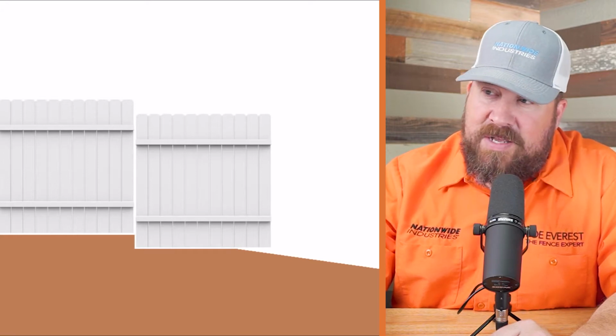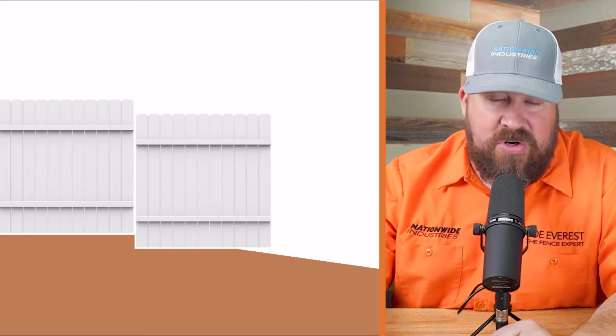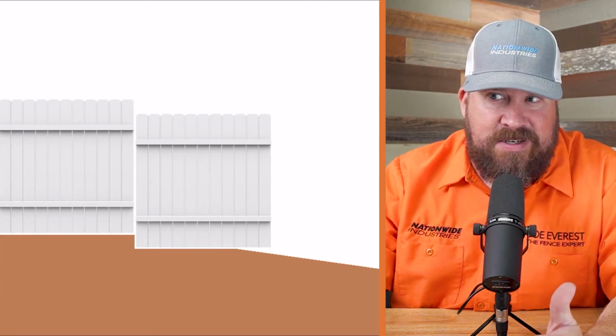So here's an example of staggering your fence panels. If you're using pre-made fence panels, they're already nice and square. And if the ground's sloped, you're going to have to stagger one panel at a time to try to make up the difference. Again, you would not want the fence panel to come in contact with the ground, so it'd actually be a little bit more pronounced than that. You would not want to dig out a trench for the panel to sit in, such as this shows.